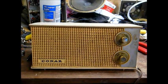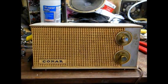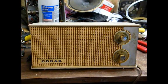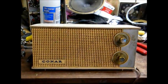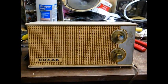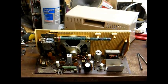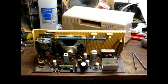This radio does not work — it's basically dead. Generally with these kit radios, nine times out of ten when they don't work, it's either due to a bad solder connection or someone installed a part incorrectly. That may or may not be the case here, but let's open this up and see what the inside looks like. Here's the inside of the radio. As you can see, it uses a nice-sized printed circuit board chassis with a nice long ferrite bar antenna.